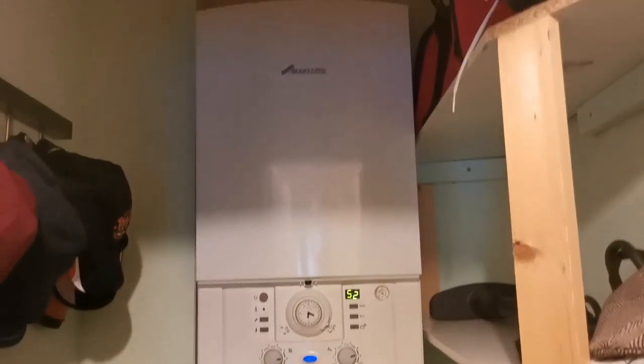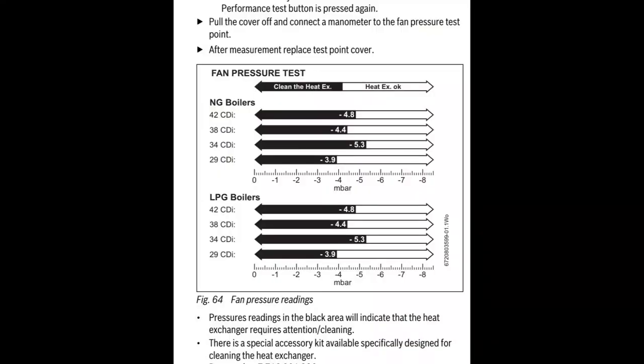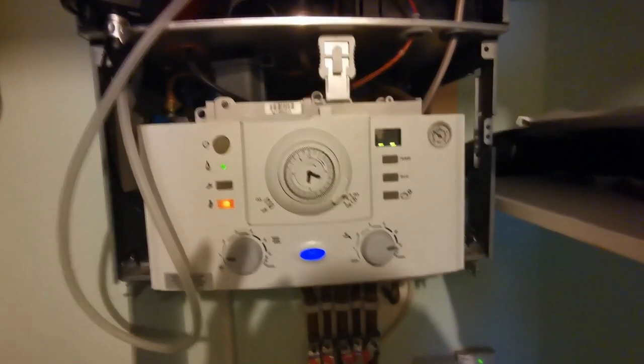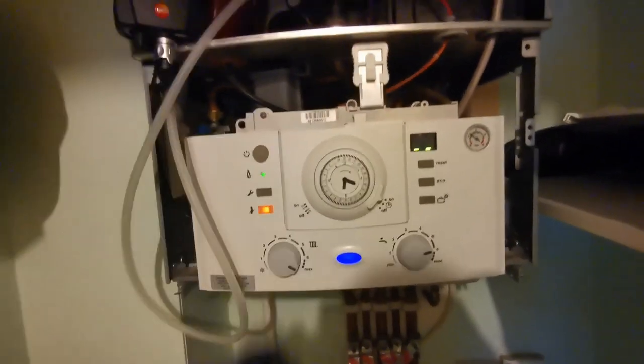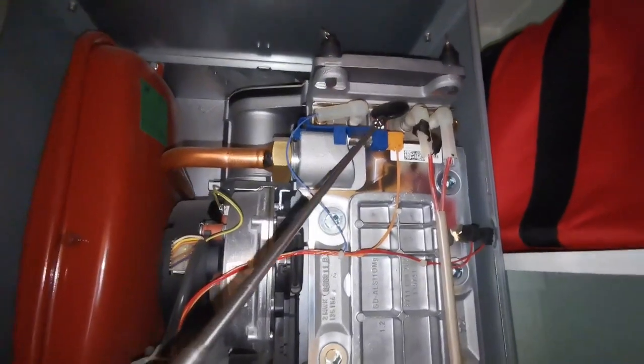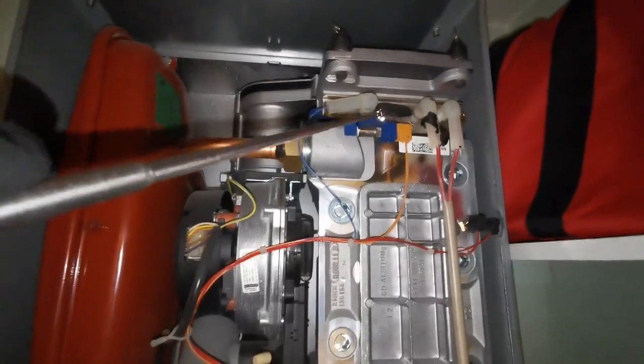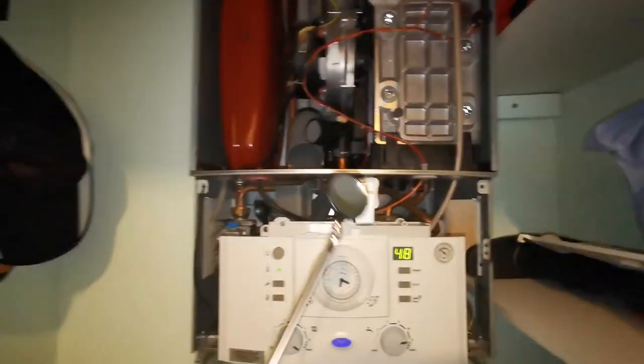She's not a bad boiler actually, probably one of the best Green Stars they've done. With the boiler in max rate, go to the fan pressure test point and you're going to get a minus reading — refer to the manual for individual outputs. Then check whether the heat exchanger needs cleaning or not. In this case it does. First, check the sight glass on the electrode bar — run your mirror around it while it's in max rate and make sure it doesn't steam up the mirror.